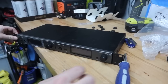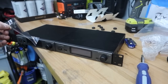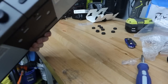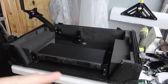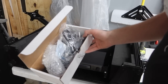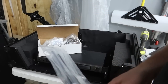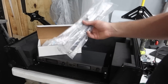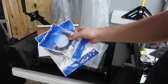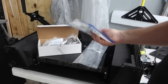We're all hooked up, ready to put it in the rack. This one's brand new, so you got to love that sound. We'll hook this up and then go through how we're going to do antenna combiners. So now we move on to wiring up the mics. To do that, we have Shure antenna combiners — those are passive, so they don't require power. We're also going to upgrade to half-wave antennas. The Audio Technica normally uses a quarter wave.